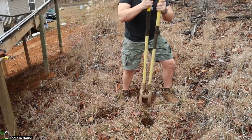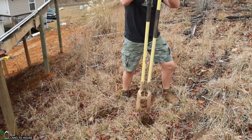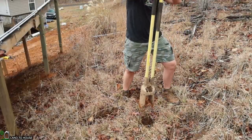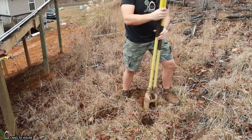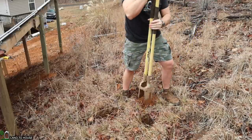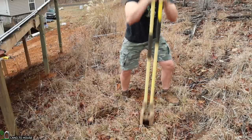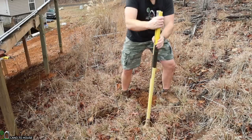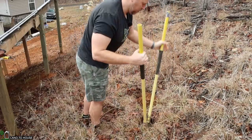As you can see behind me, I have my other three kilowatt solar rack, and I've got nine different 4x4s sunk into the ground, and that has worked just fine. But on this new setup, I'm only going to do six in the ground, and I think that is going to be more than sufficient to keep this from blowing away in the wind, especially where I am here. If your location has a lot more wind, then you may want to consider adding those extra supports.